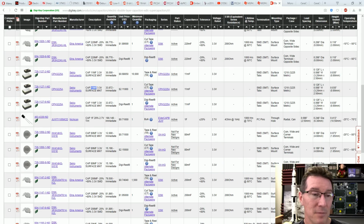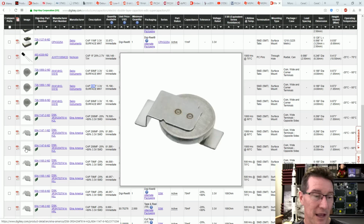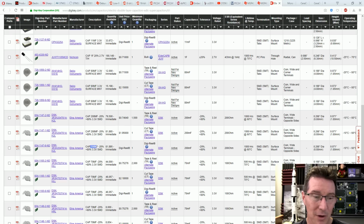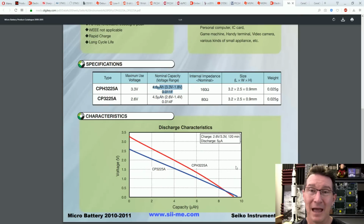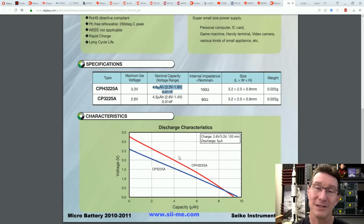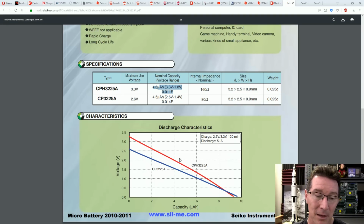Okay, so they're 11 millifarads, 80 millifarads. We're still not there. Look, these are getting decent size ones, but you know, 200 millifarads, we're still not there. It was only like a couple of hours discharge, and of course, you have to watch the thing with batteries and with supercaps as well. You have to look at the time over the minimum discharge.